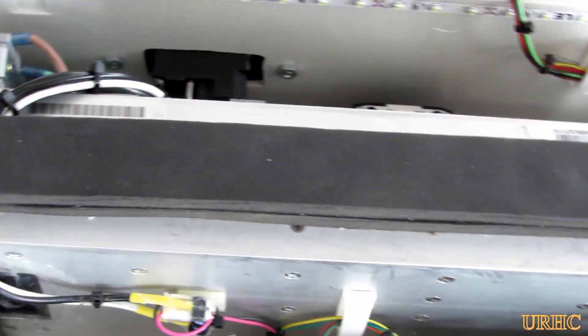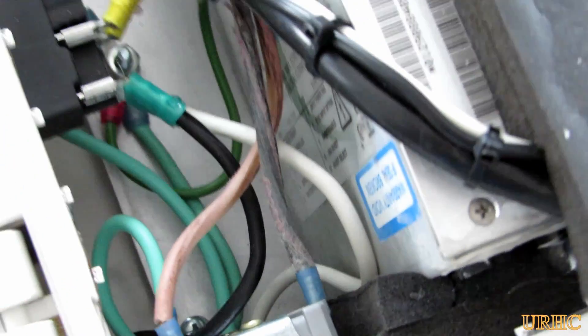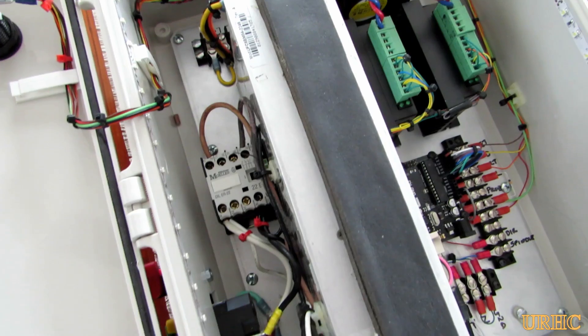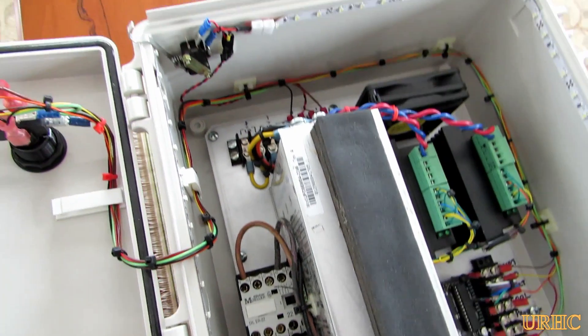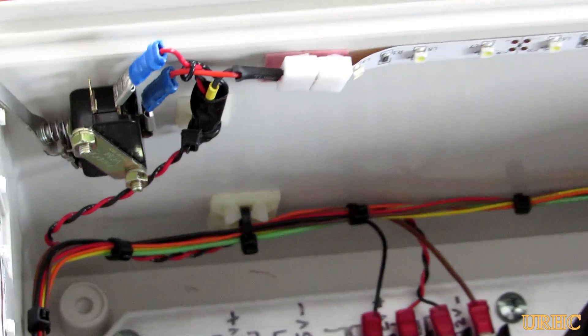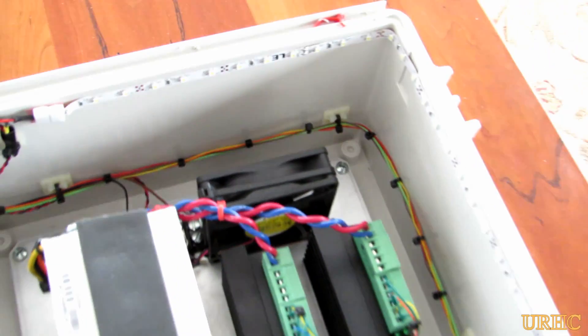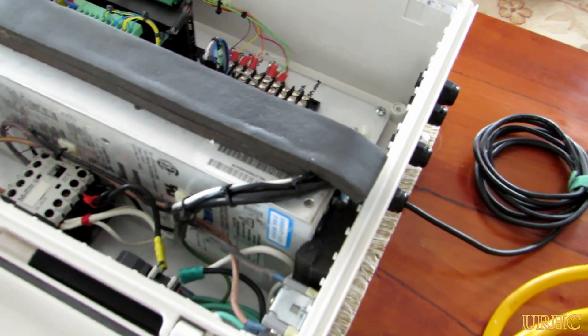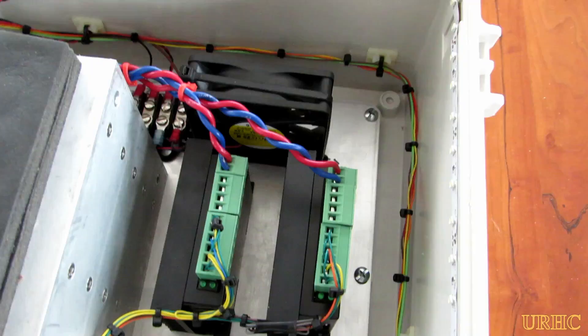On the inside you can see it's all the hardware I had on the other panel, plus these switches. I added another fan to blow down on the separate motor controllers, and then I added a relay — actually a contactor — to control the spindle. There you can see the back side of that magnetic switch. It seemed like a pretty good deal for about eleven dollars. I also added some LEDs around the inside of the box with a little switch to turn them on when you open the cover, since I had extra 5 volts and 12 volts available from the supply.